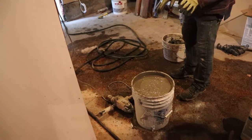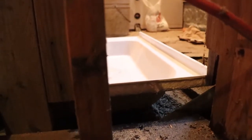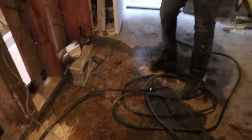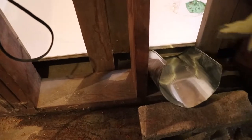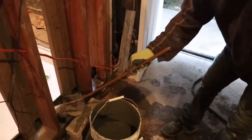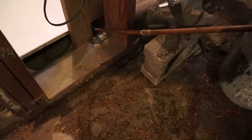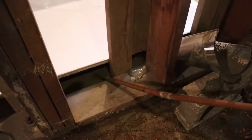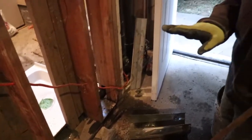The reason I like it liquid — I have the hole there where we did the drain. I want to put the concrete here so at the same time it supports the shower base and fills that hole. My idea is I have a piece of pipe so I can shoot the cement right in there. I'm just gonna put the cement in here to run underneath the shower base and fill in the hole at the same time. You guys can see where it's going — it's already spreading there, filling the hole, and the other side is already going underneath the shower base. I think we have enough here to support the shower base, I'm just gonna push it in a little bit more.